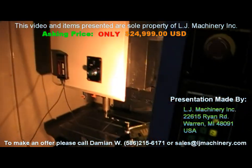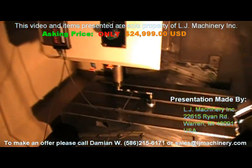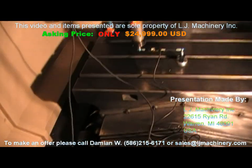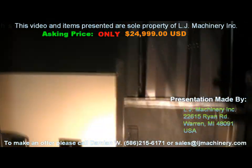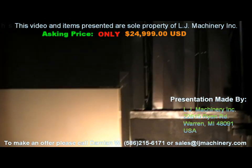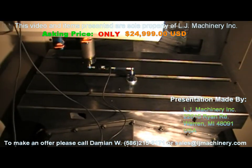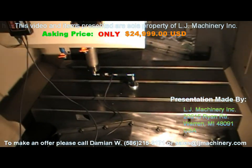This machine is in very, very nice condition, as you can see. None of the machines I've seen on eBay or at other dealers are in that great of shape, and I can bet none of the machine dealers will put them under a ball bar tester. This one has all the ball screws checked out — X-axis ball screw, Z-axis spindle runout — it's checked out. There's no runout, the table is very straight, and you can see the squareness results on the ball bar test.